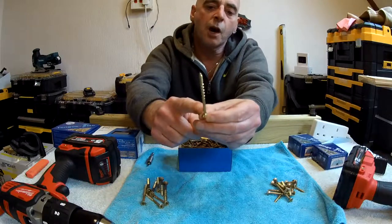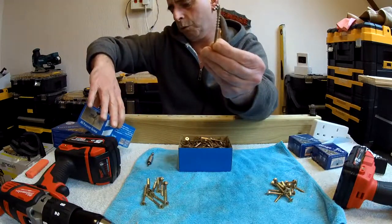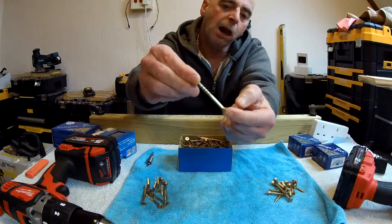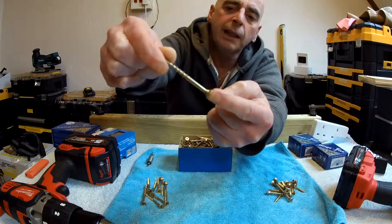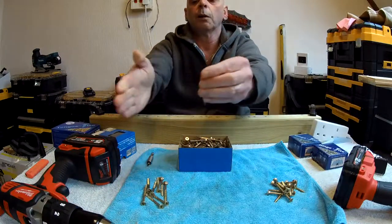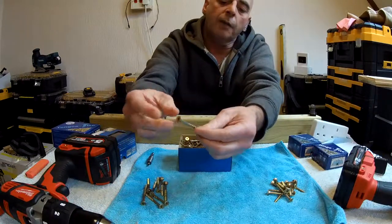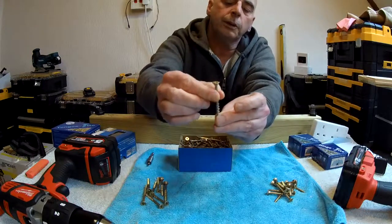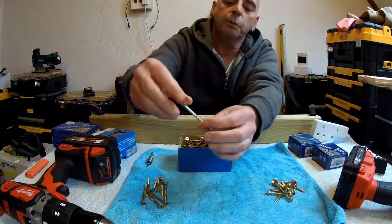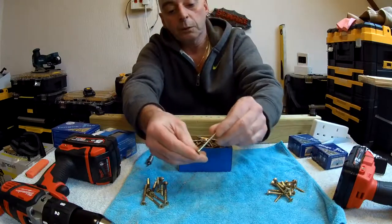The thread stops part way down and this has got a tri-lock shaft. If you look at it, the shaft is actually a bit like a triangle with round edges. What that does is when it's going into the wood, it pushes the wood out of the way slightly, which helps prevent splitting. The shaft is thinner there, so when the tri-lock section comes into play it moves the wood out slightly, meaning it won't split as easily — so you can possibly go quite close to the edge.